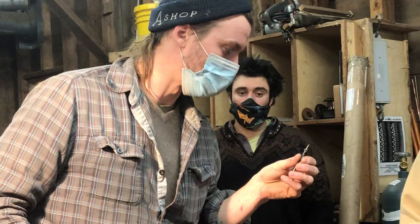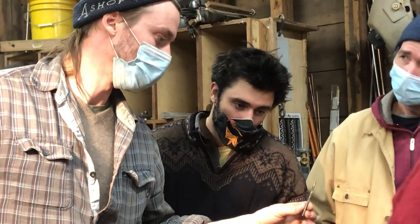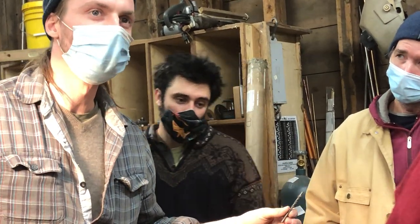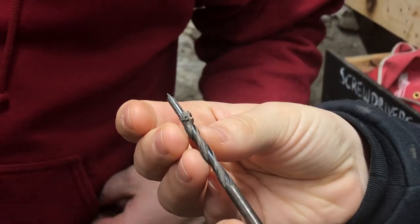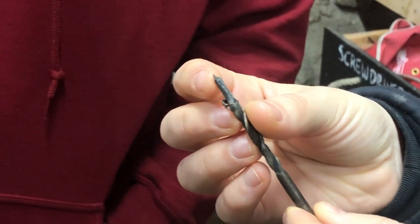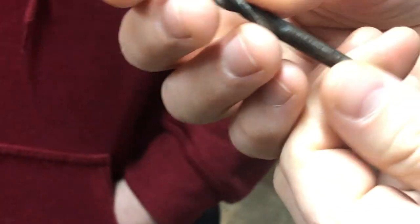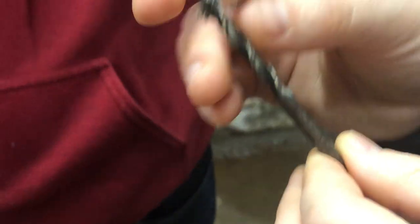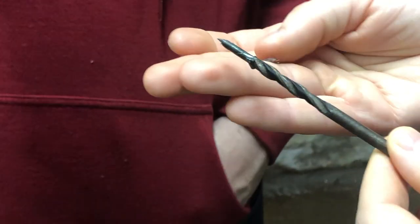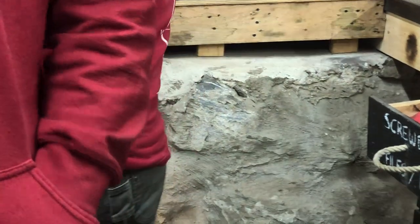Oh, this is a great example too of things not to do. This is a brad point bit that was tried to use on steel. I showed you a couple of these. No? I thought I did. Oh, that's cool. It just melted the bit? Is that what we're looking at? No, but when you have that swirl of a temper being gone, the edges are rounded over, there's chunks missing out of them. They just sheared it? Yeah. Oh, I see. Okay, the flute. The flute is off of the central stem. It's crazy.